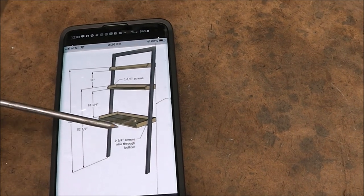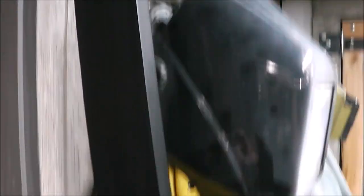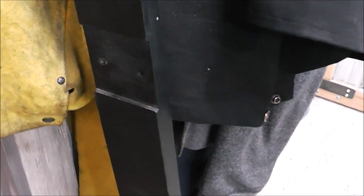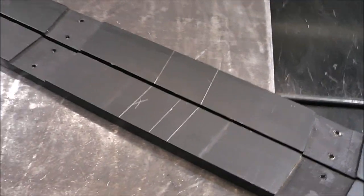Overall this is going to be a little over 40 inches wide. Here's one of those two brackets. There's going to be a shelf here and another one right here. This one won't be used and she said that's fine if it's exposed. This one will have to be scarfed out because that one is roughly 30 inches above the floor — that will be where the actual desk work surface is. Here are the two pieces together and I'll show you how I made these marks.